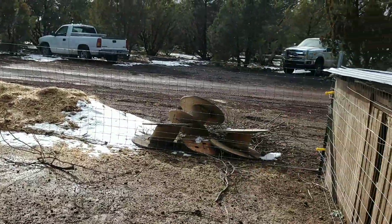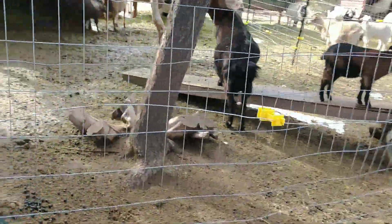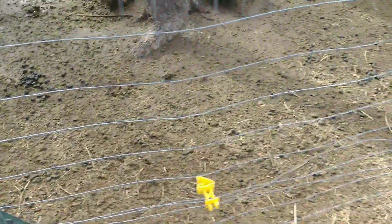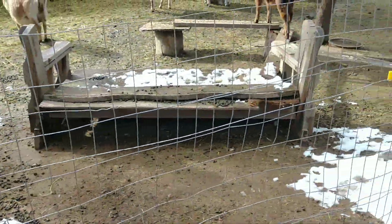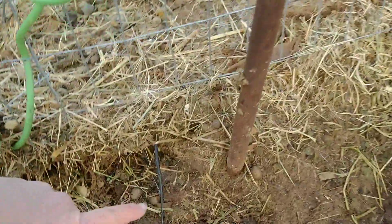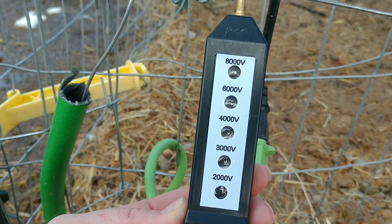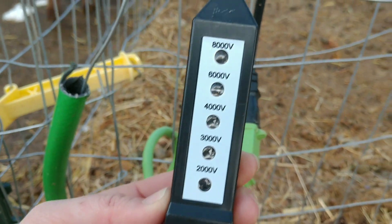So I'm going to walk this whole fence line - it's obviously something in the front. Before it was connected over here it was still only 2,000 volts, and you want it to be at least 6,000. Let me check over by my fencing here. Everybody's jumping up on me - they're going to get me all muddy. I'll check this whole thing out and I'll come right back. It was actually my tester - the cord right here wasn't fully connected to the rod. So now if we check it, it's at 6,000 - 6,000 to 8,000 actually. Now our fence is working correctly.